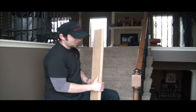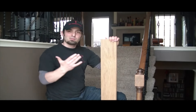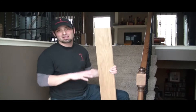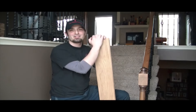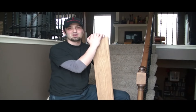What we do is we install the hardwood directly on your existing treads and risers. So we're going to rip off the carpet, we're going to trim off the bullnose, and then we're going to install this piece — it's a white oak nosing — and the flooring directly on the treads and risers, and we're going to remove and replace the balusters. It's going to look gorgeous when we're done and we'll come back and show you the process and the finished result.